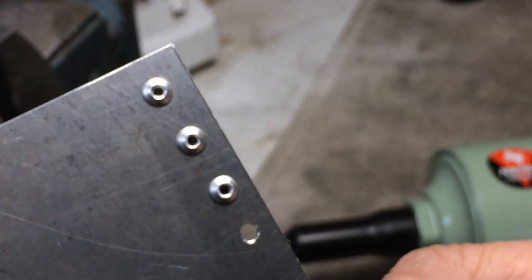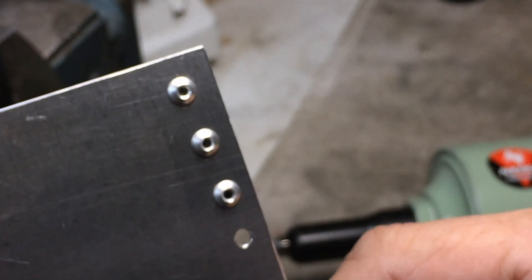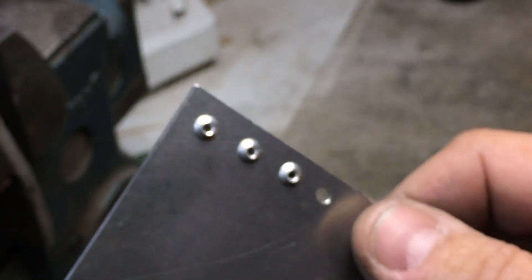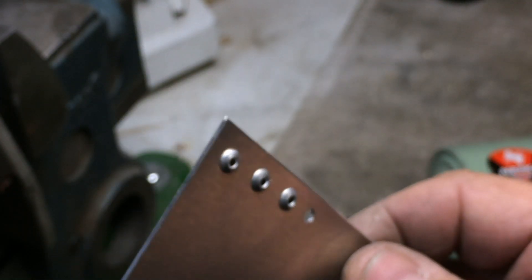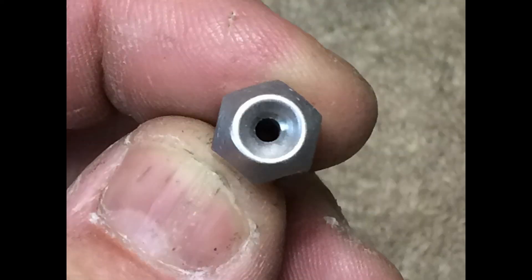The easiest way of course is in a lathe — that takes you a couple of minutes to set it up and run a quarter inch ball end mill down there and then polish them. But this is quick and easy and gives a real good rivet head. There's not a thing wrong with it. It takes less than five minutes to do. A carbide burr is probably $10 from Home Depot or Lowe's or whatever your home center is for your little Dremel — everybody should have a Dremel if they're building. Anyway, thanks for taking the time to watch. I hope this helps you a little bit.